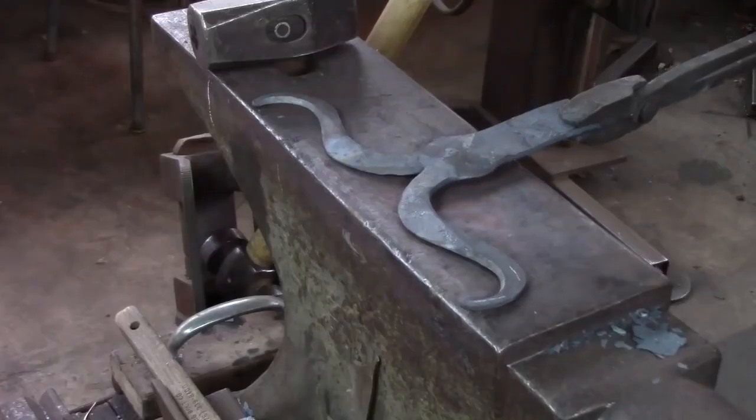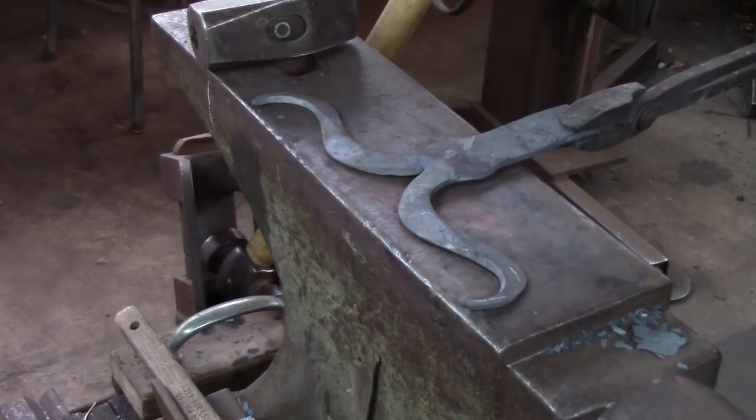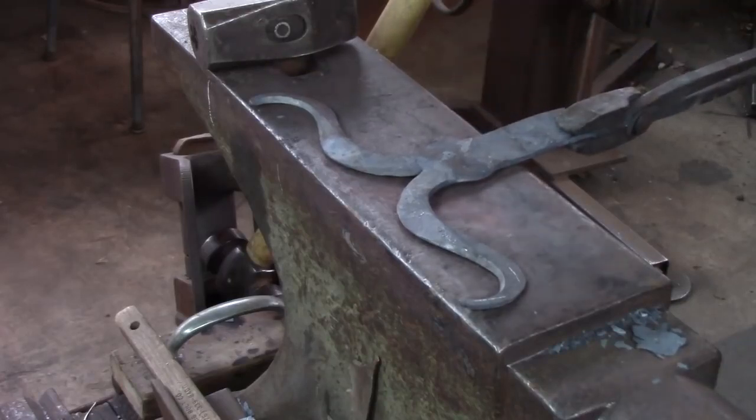Remount your horns to the edge of the anvil, and then check to make sure that the head is perpendicular. Sometimes when pulling out the cheeks for the face you can move a horn, so make sure those are correct. If not, put them back in place.